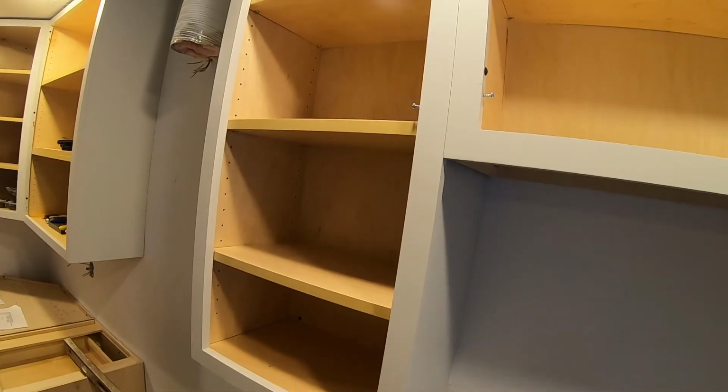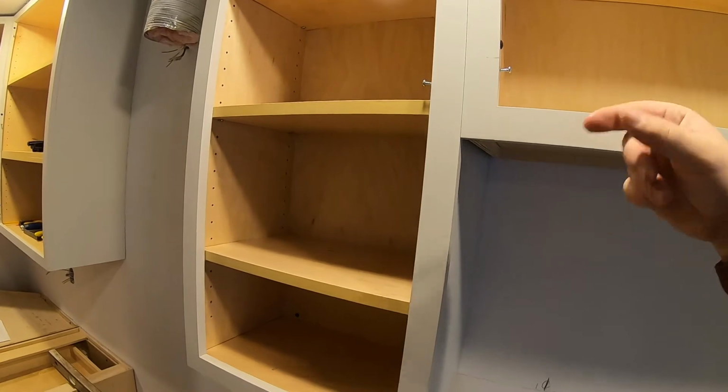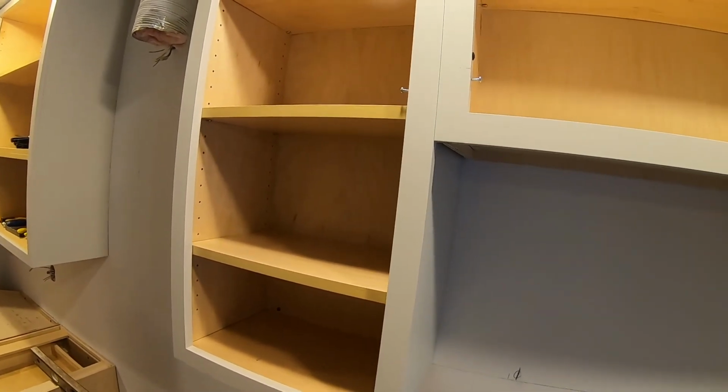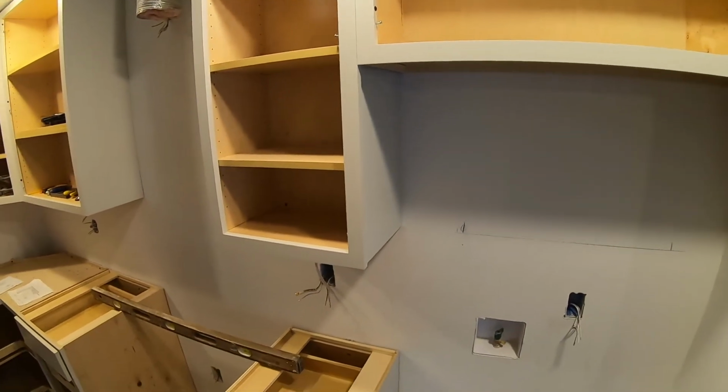And I was using 2 separate drill bits to do that. So I drill an initial hole, and then I get a bigger drill bit, and then I just drill this part out. There's actually special drill bits that you can buy that are wider here and then thinner over here. I didn't have one of those today, but I'm just letting you know that those exist.